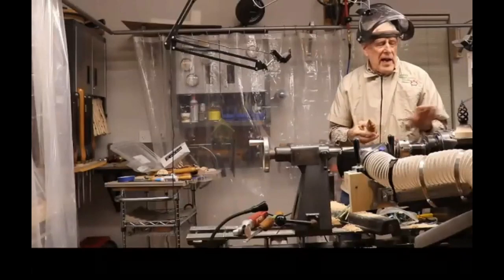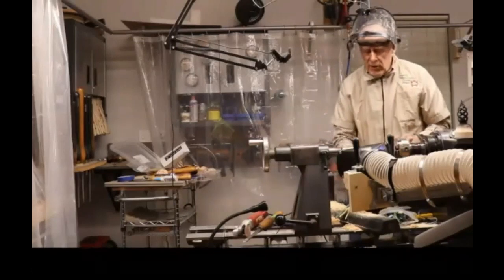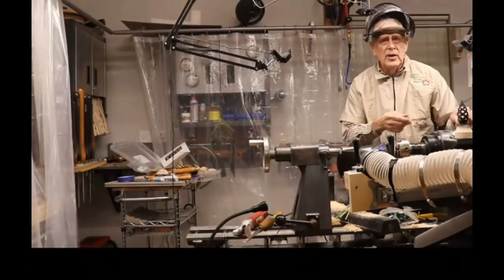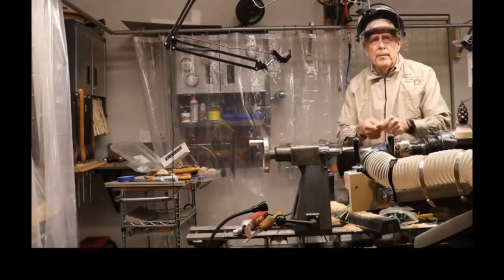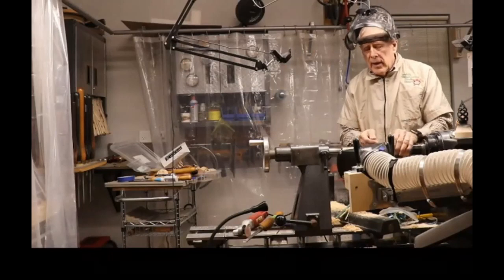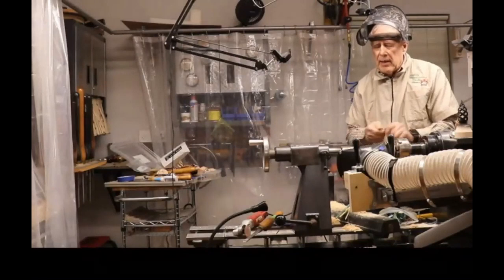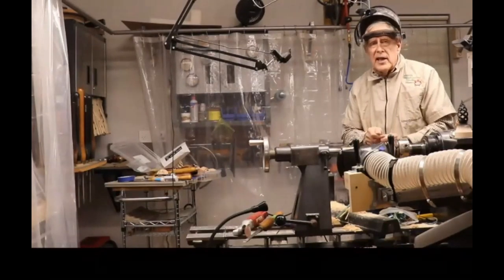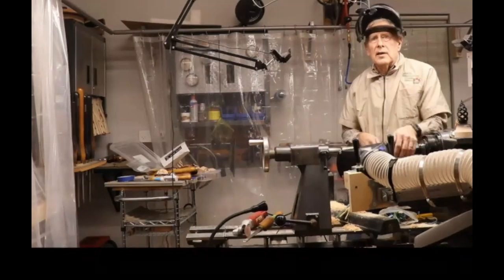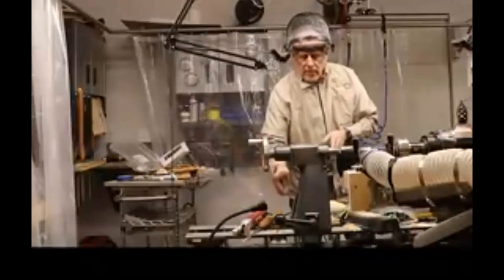If you don't have the carbide cutter, what you can do is, you heard of Surform tools? The Surform? Like a planer. Yeah, if you make a saw cut along the bind lines with a back saw, and then take a Surform tool, you can do basically the same thing without having the power tools. But that's how I do it.